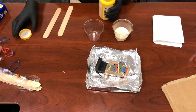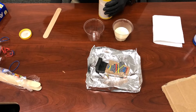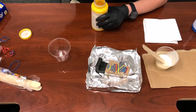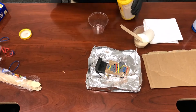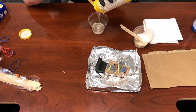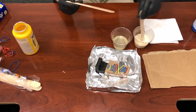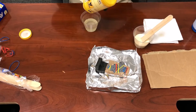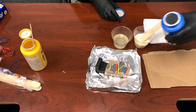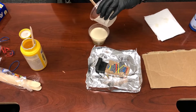But there, I just put the Part A mixture in. And the Part B that I have, since I've had this product for like 10 months, definitely has a limited shelf life. It formed like a crust already on the top, so I have a little bit of solids in there. But yeah, I'm just pouring that mixture, trying to get them out to equal levels. The nice thing with Smooth-On is their products are mixed by weight or mixed by volume. So I'm just doing volume here, just trying to top it off, get it pretty even.